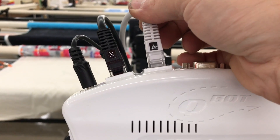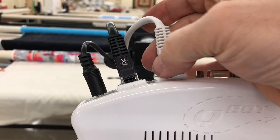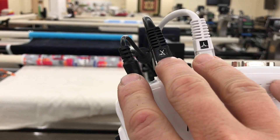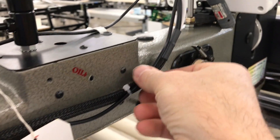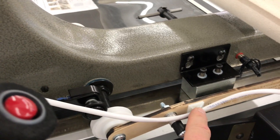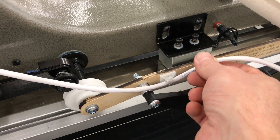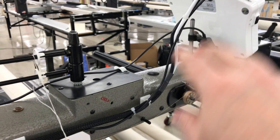The next step is to install the wiring harness. The wiring harness used on this model is a 5x7 wiring harness — the white or Y wire is 5 feet long and the X wire is 7 feet long. Also plug in the power supply connector. Those are the three connections. From the back of the machine, collect these wires and use wire ties along the path to keep them nice and tidy. Use the enclosed strain relief pads, stick them on the side of the machine at multiple points to keep the wiring harness neat. Use zip ties to attach the wire to the strain relief pad, tighten them up and clip the zip tie. When it's all done, everything will look nice and clean.